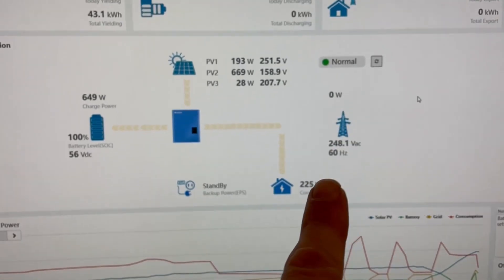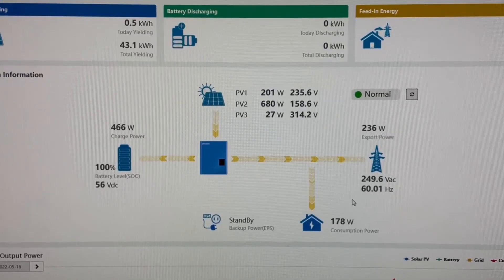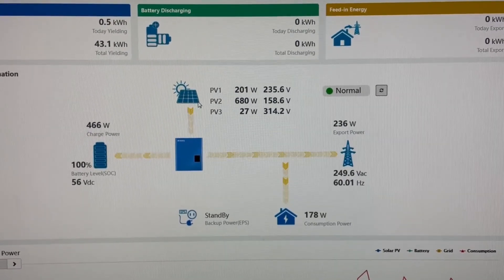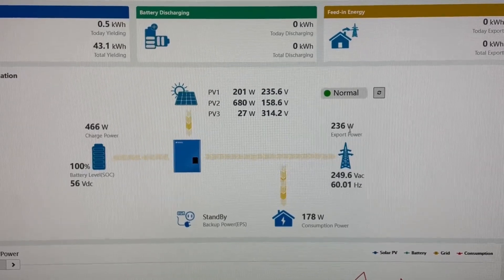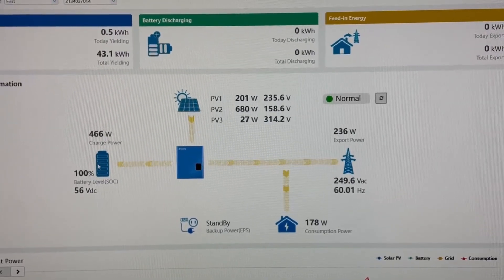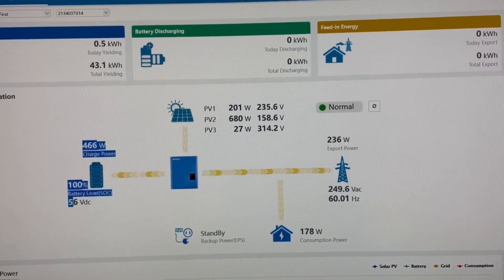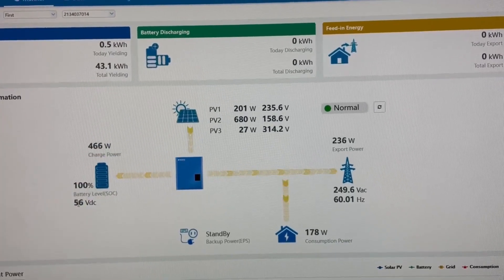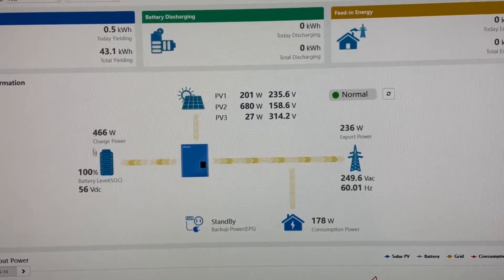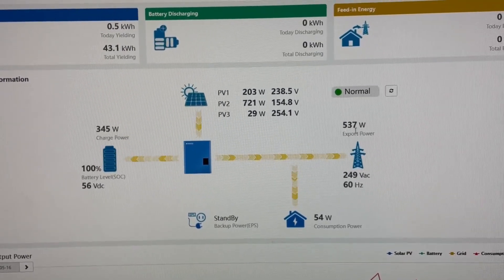You can see that we're not pulling anything from the grid. For whatever reason my heat pump is only using 225 watts. Oh look at that — it's even pushing power to the grid, I haven't seen this before. You can set it to do zero export, but apparently right now I have it set to the default: provide battery charging and consumption first, then if you've got extra, send to the grid. This is set to 56 volts as being full, which is a little bit low — that's like 4 volts per cell on a 14S lithium ion battery. So it's pulling in 466 watts, and could do up to about a kilowatt if the battery wasn't full — that's why some of it's being sent to the grid.